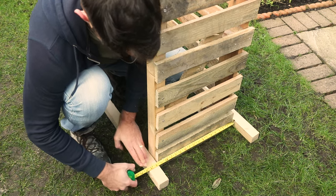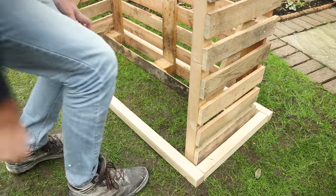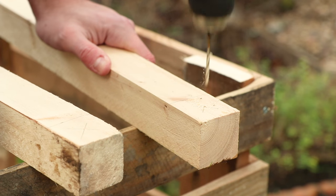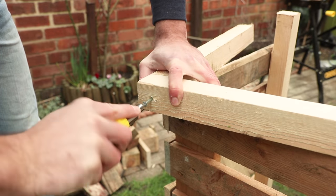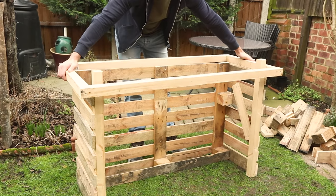Again add an extra 5cm for safety, then cut two more pieces of wood to this size — this will form the frame for the roof. Now we'll need to attach these pieces of wood together, so make some pilot holes where necessary, then screw together with some heavy duty screws. When you've finished assembling the frame, check it clears the top of the log store and fits nicely.